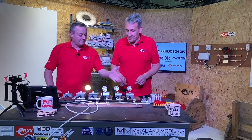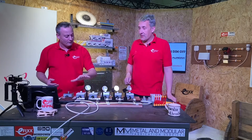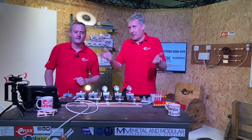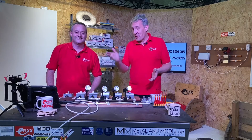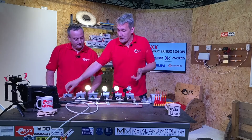That's obviously unacceptable. We've gone from a reasonably priced online seller with next-day delivery but now we've got a problem. What's caused it? It's quite simple — these are not dimmable lamps, not designed to be dimmed, and that's causing the flashing problem.